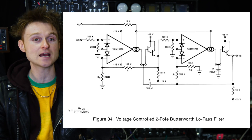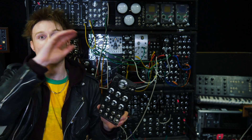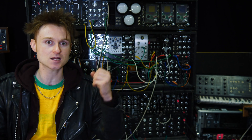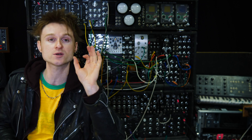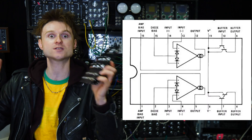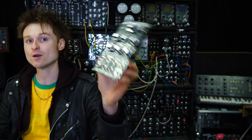With this particular filter, I started with the datasheet schematic of a low-pass filter and basically just kept fiddling around with it until it started sounding a bit funky. I then used a second LM13700 to act as a voltage controlled amplifier — taking the output of the filter and sending it back into itself to act as a resonance control. Resonance is basically feedback — like getting a microphone and putting it at a speaker. Usually in a standard low-pass filter, resonance is controlled by a volume knob controlling how much signal goes back into the filter. Since we're only using one side of the LM13700 for the VCA, I had a whole other side left over, so I added another VCA. In theory, to make a whole synth voice, all you need is an oscillator, an envelope generator, and this thing.